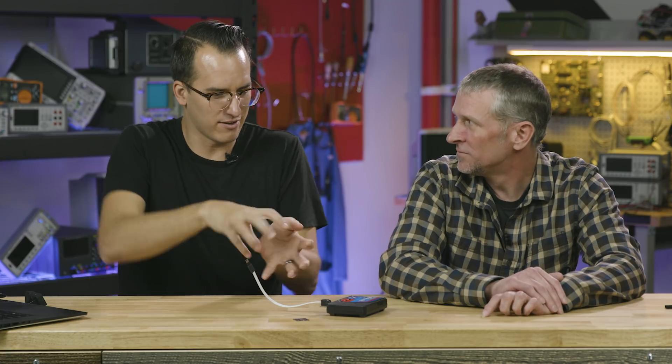The cool thing about this is that all the spacing between alignment pins on the other side of the board is available for components and traces, versus if I was using the 100 mil strips I couldn't use the other side. This takes me back to the logic analyzer days — logic analyzers have these 40-pin probes, they called them soft touch probes. As you pressed them into the board they had little teeth on the end and would twist a little bit and really lock in. I think one of our scope probes has a Pogo pin on the end too.